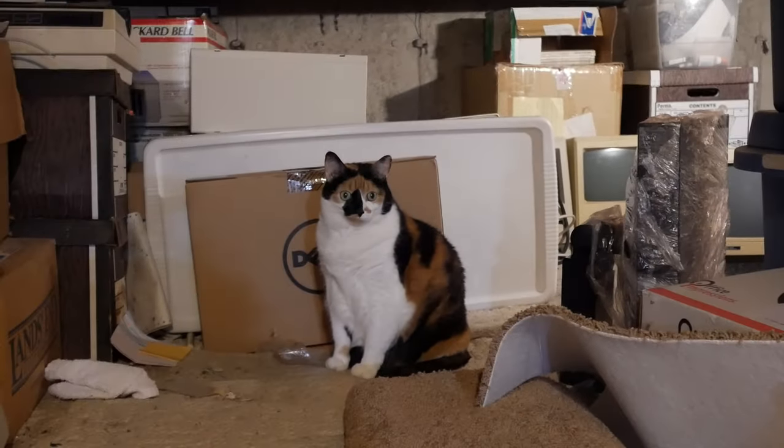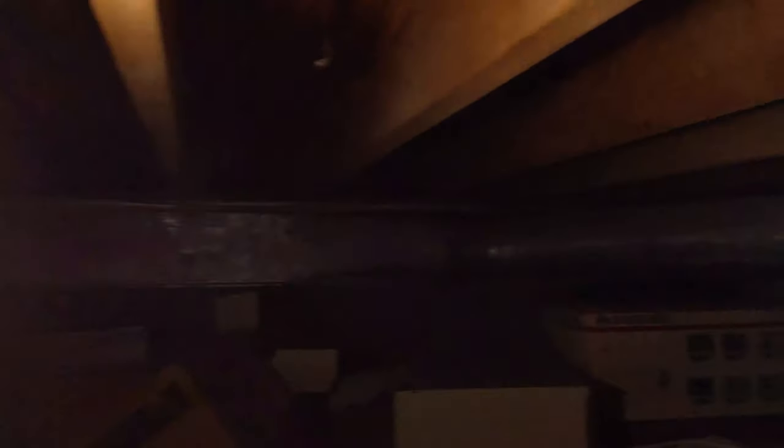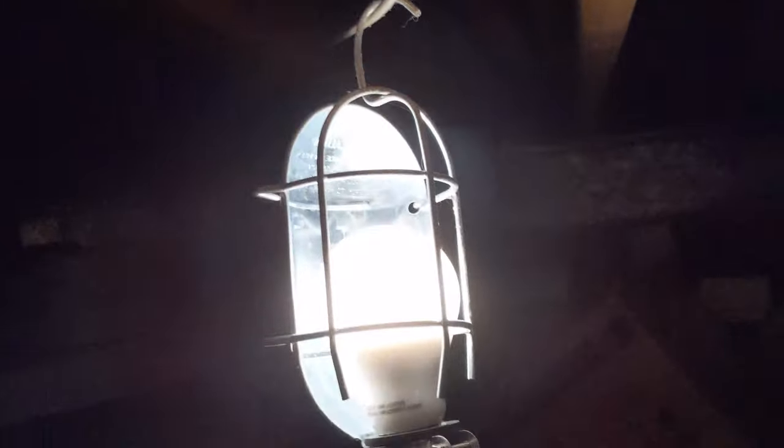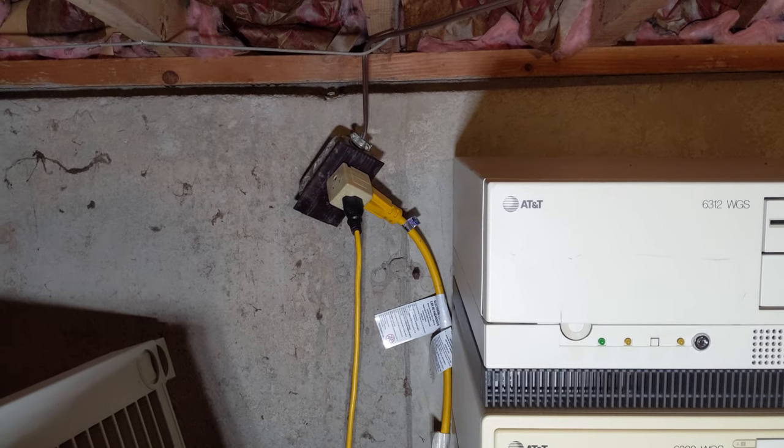I had taken for granted what the power situation was like in the crawl space, so I decided to take a closer look, and what I found was disturbing. I've already run into my first snag — in order to plan where I want to put the lights, I followed the old shop light's cord and found something that doesn't look very safe. It's using a 3-prong to 2-prong adapter and it's just hanging. Following the cord all the way to its source, it goes all the way to the opening of the crawl space, so I'm running electricity from the beginning all the way to the end, and then all the way back again.